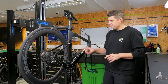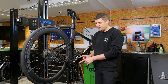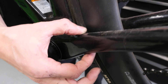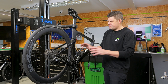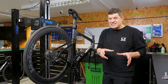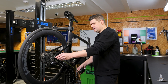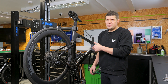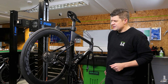Now we're up to the modern era. This is a Cannondale System 6 — 68 millimeter shell width on a PF30. It gives us loads of surface area for making very wide and very stiff chainstays. Because of this more advanced carbon fiber manufacturing, we can start doing a lot more with the shapes, which means we can now accommodate at least a 25 millimeter tire. And most impressively, our chainstay length is back down to 40 centimeters — the same as the Swinerton I showed you at the start. It's taken us all this time to get back to a decent chainstay length.